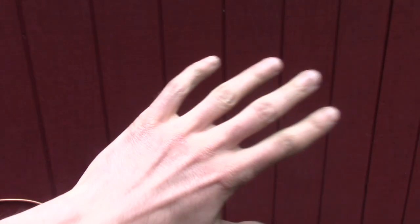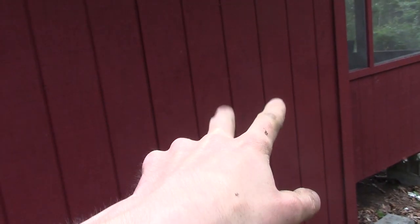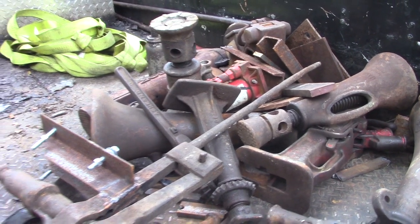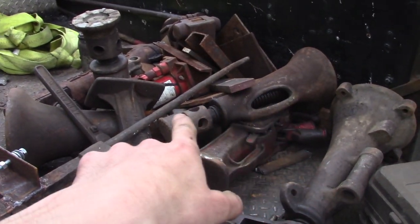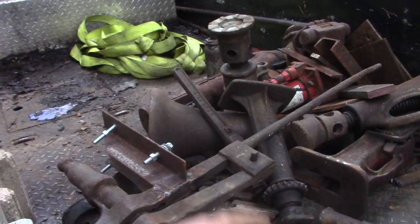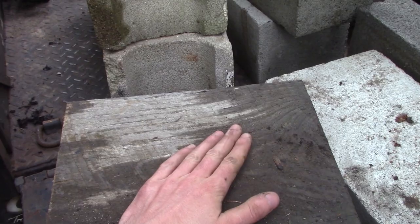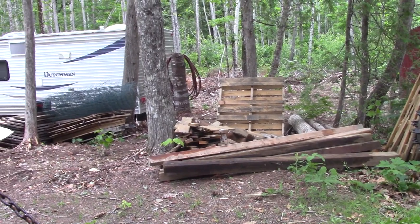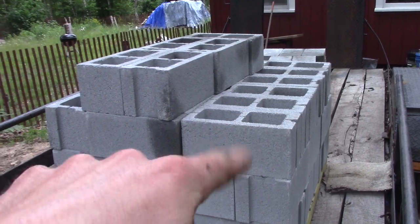In the wood stove area — right about here — we're also going to put some water storage barrels in there, two 55-gallon drums. That's going to be quite a bit of weight, so I'm going to put some extra footings under here. I've got a whole pile of jacks — 14 or 15 — a few hydraulic, most are mechanical. Some are pretty long for under the porch end where there's clearance. I've got some pre-cut chunks of wood as a foot for the jack so it doesn't sink in the ground, and pressure treated two-bys and one-bys for shimming.